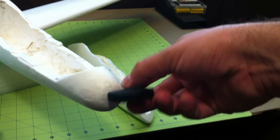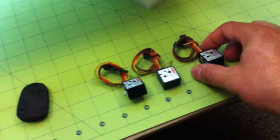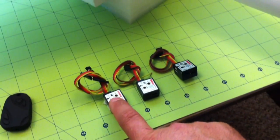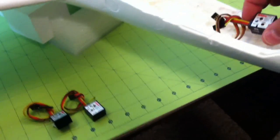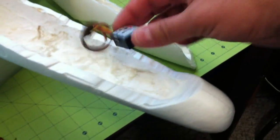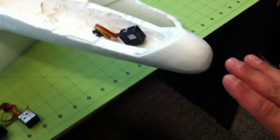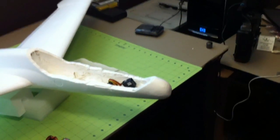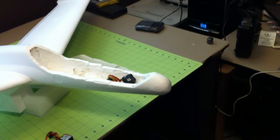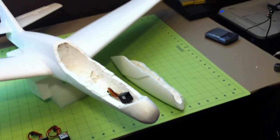I'm gonna hook a servo to the camera, and I've got a bunch of little gyros from my helicopters. I'm gonna hook a gyro up in the nose and connect it to this camera so I can set it to point at a certain angle down. It doesn't matter how I fly the plane — the camera is always gonna stay pointing at the ground at the same level. So as I'm doing climbs and dives, the theory is the camera is going to be pointed in the same direction toward the ground, and I should be able to fly all over the place and get a good shot of the ground.